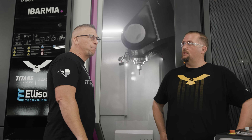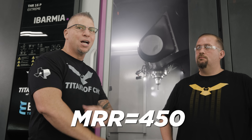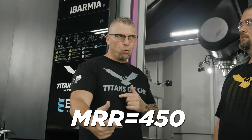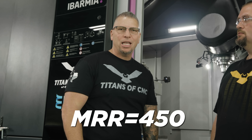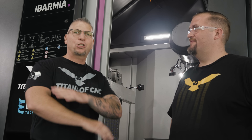450 MRR — and I thought, we're at a depth of 300, if you're at 450 just go 500. So now we're at 0.335 inches radial, three inches deep, 500 inches per minute — that puts us at 502.5 cubic inches per minute flying off of this thing. That's a good cut for an end mill — that's a good cut for anything.